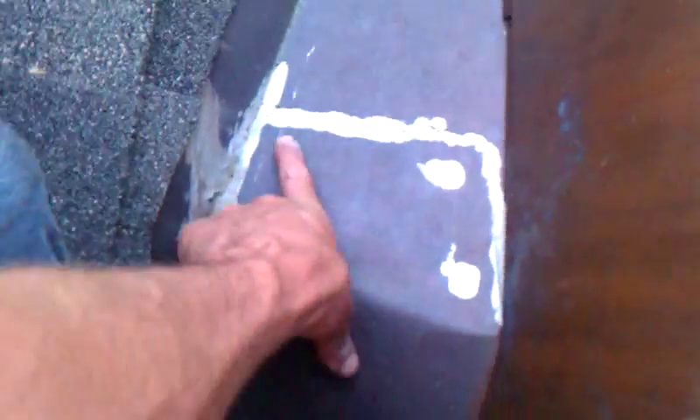Looks like they've got some pretty good water stain back there — they probably got something coming in here. I'm not even going to pry this loose because I know what's going on. They've actually nailed through this cricket, through this copper. To hold it down, basically what they do is put a gutter seal on their copper to make it look like it's been soldered.